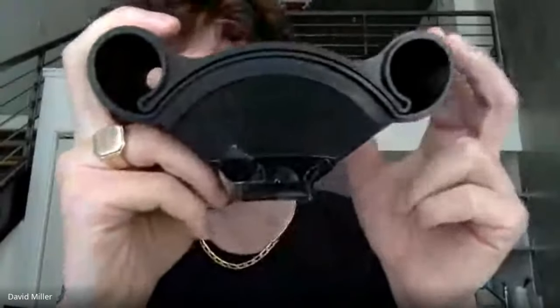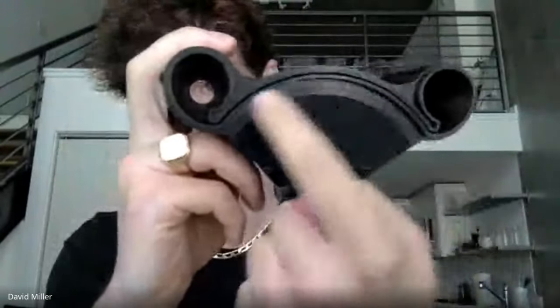What's cool about this is this focal plane is curved concentric to the pinhole in the front. The pinhole is just a piece of foil in here with a 0.2 millimeter pinhole. What that allows for is super wide images, like a 150 degree field of view, that has almost no distortion, just because the focal plane is curved concentric to the pinhole. It takes 120 film, and then it takes two 6x6 frames, essentially like a 120 in circumference, and then it wraps around, and the pinhole's at 65 millimeters.